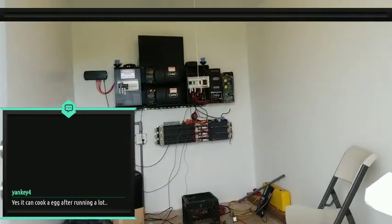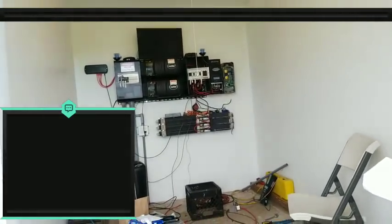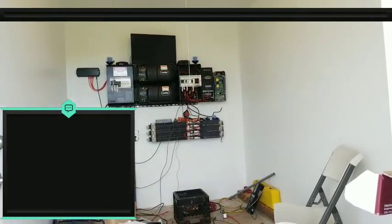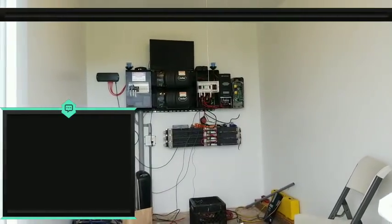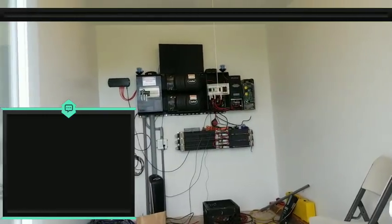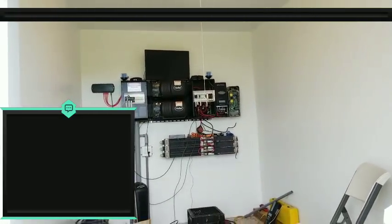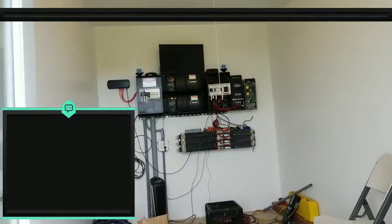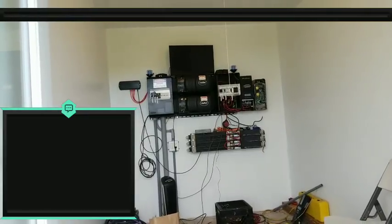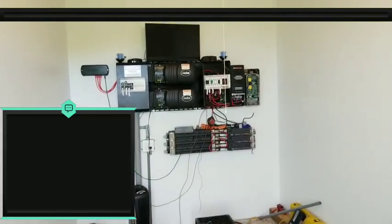And whatever my total kilowatts is, I'm actually taking 10% off the top and 10% off the bottom, because I'm not trying to push my batteries any higher than I need to. My sweet spot is going to be 58.8 volts really, and I try to just keep them there. But I won't go 10% up and I won't go 10% below the minimum, to keep them healthy. But yeah, kilowatts is a lot easier way to figure things out, I think.